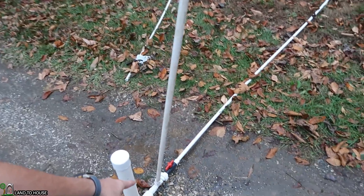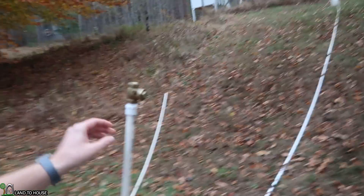You'd probably want to put a board up to lock the standpipe down so it doesn't shake. A practical application: say you had a waterfall and needed to have the pump resting on the ground — if the head pressure was too much, just extend the waste valve pipe up a bit to reduce it. Thank you so much for watching. If you love ram pumps, subscribe, hit the notification bell, and leave a comment. I know it's November 2021 and last year I responded to 16,000 comments; this year probably only 8,000 — I do read them all.